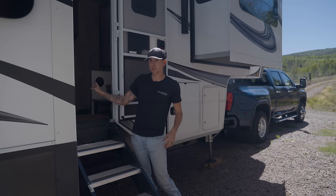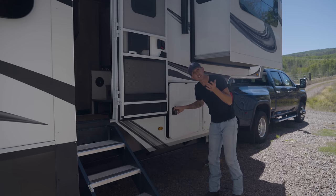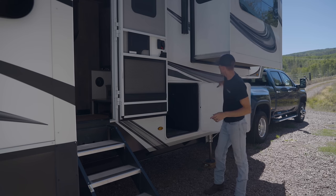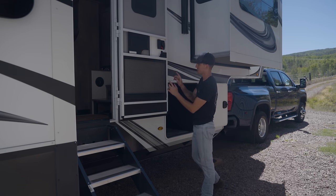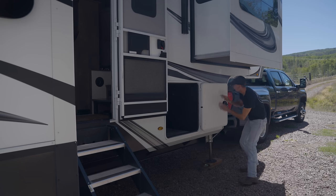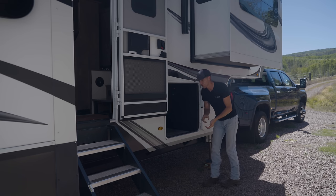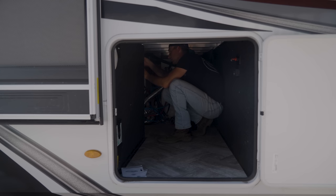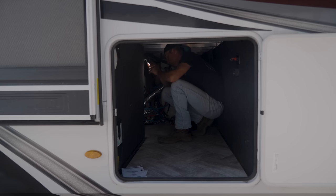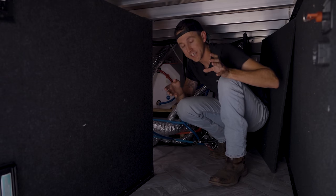Back on the ground, the inside of the camper has the 120-volt breaker box just inside this cabinet, but we don't really need access to the front side - what we do need is access to the back side, which is just inside of this door and around that wall. Since the breaker box is behind this wall and our factory batteries are behind this wall, this is going to make a great space to put our batteries, inverter, charge controller, and all that kind of stuff, giving us easy access to tie into the factory wiring without having to run wires all over the place.